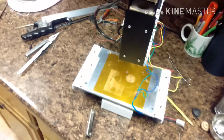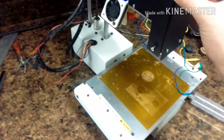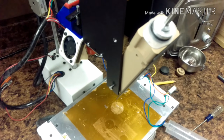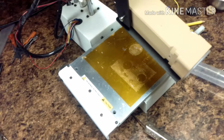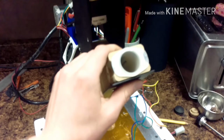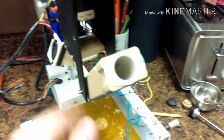I have the plunger right here, but I can take it out. There it is. So we've machined, cut and manufactured 2 aluminum pieces for this so far. We have our plunger, which is a nice snug fit. That works well. And we have our aluminum plate, right here. I really like that you can get it vertical, but it won't just fall down. Naturally it'll stay like this, but it's just enough pressure that if you push down, it goes down.